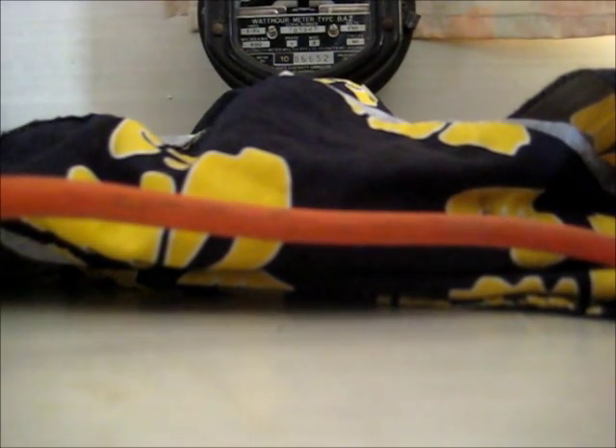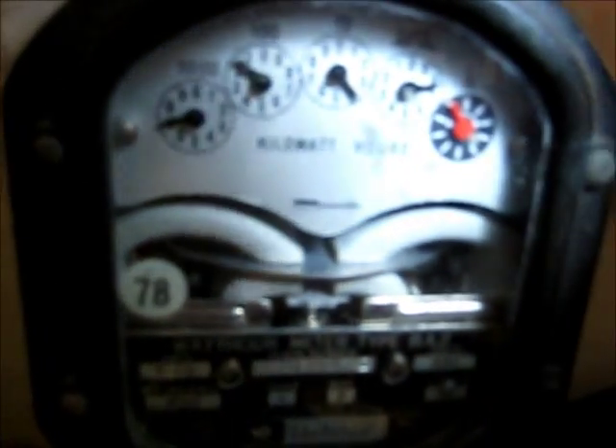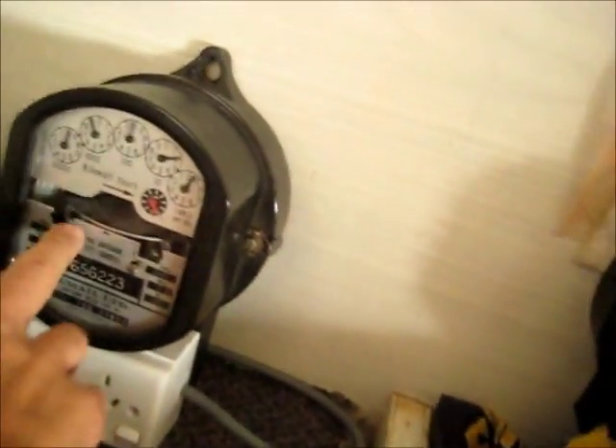My test load is a 600 watt vacuum cleaner. Let's plug this in and see if it works. It's working — very responsive; the brake magnet stopped the disc perfectly still, which is good. Now let's wire that up and advance it to the next notch on that unit so I've got something as a guide to start from, then do an accuracy test. It's obviously going to measure a tiny bit more because of the potential coil this meter uses.